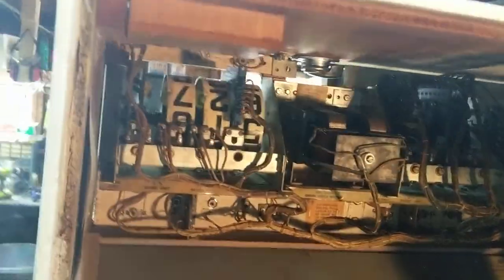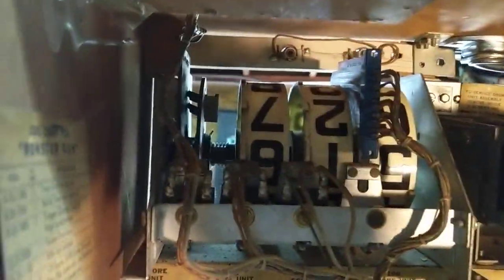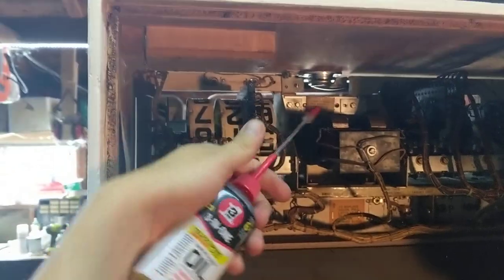The lubricant on there is old, so sometimes these won't spin freely. While the motors are running, you should be able to lift your finger and trigger these little relay catches, and the disc should spin freely all the way around. If that happens, you're in good shape. If not, you can get some 3-in-1 oil and just squirt a couple of drops on each set of reels. There are some leather washers that separate the different sections — just get a good light, you can see them on either end of the spring. A couple drops of 3-in-1 oil gets it moving again. This 3-in-1 oil has a little extender spout that goes really fine and far, so it's really handy for getting into those little crevices.